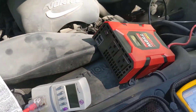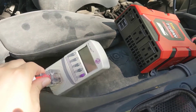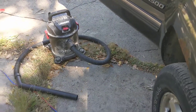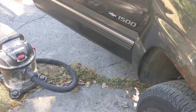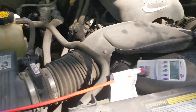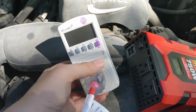The second reason: I was using this for small loads before. It's not capable of running a single window air conditioner, which is less than 750 watts — though that's probably because of starting current. But I was using it to run this shop vac, and the shop vac barely started. When I say barely, I mean when I flipped the switch there was a little suction for a split second, then it stopped, then it kind of ramped up as the inverter recovered. Even running, it wasn't at top speed — I could tell by the sound.